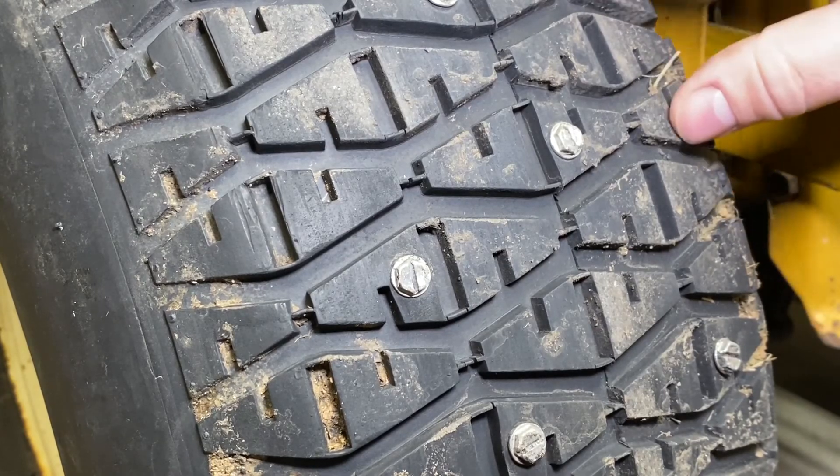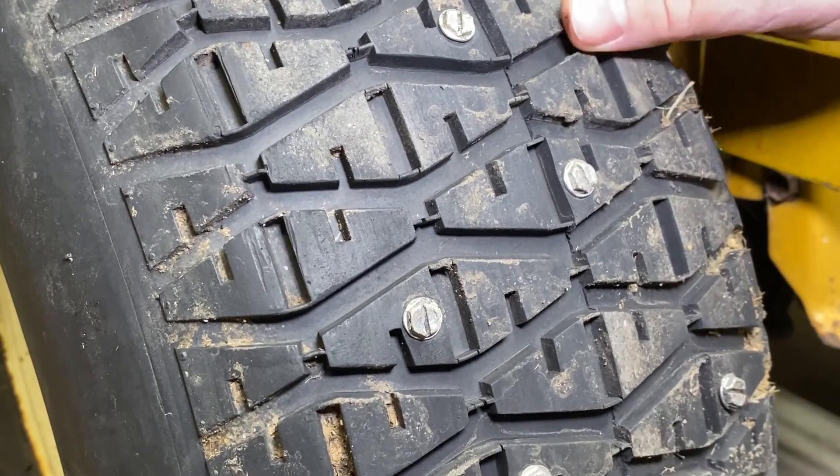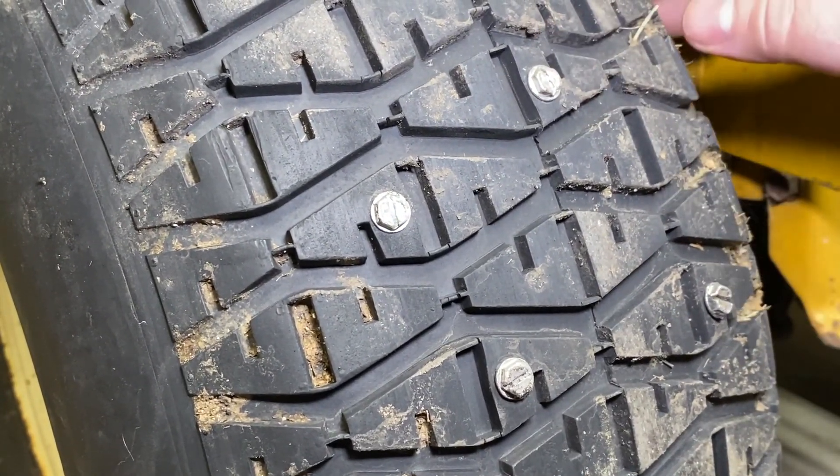So you can stud your own tractor tires to get you out of a pinch for traction, and it's pretty cheap and not hard to do. It is possible to stud your own tractor tires, but I'd only use it as a temporary solution due to the amount of wear on the studs and three of them backing out — it's not going to last too long. The reason I did this is because last fall I picked up the snowblower attachment, forgot to get tractor chains, we got hit with snow, and I had to act fast to get our driveway cleared off. This worked, but I'd only use it as a temporary solution.